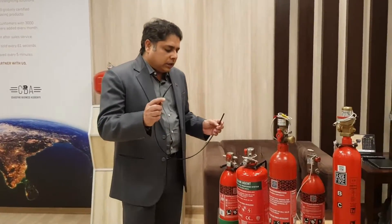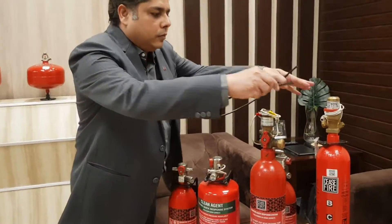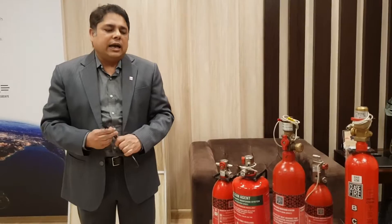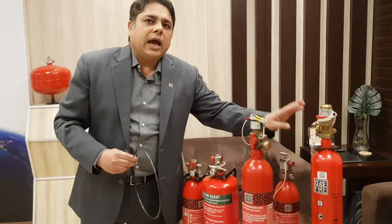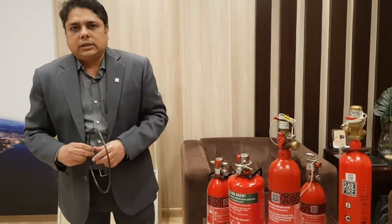The way this tube is used defines the two categories of CQRS. The tube is attached as a pressurized section to the head of the valve. If the tube plays the role of detecting the fire and delivering the extinguishing content to the source of fire, we call it a direct system. If the tube plays the role only of detection and the extinguishing agent is sent out through a different port, then it is called the indirect system.